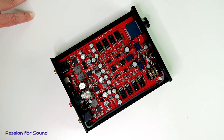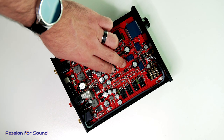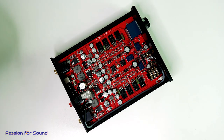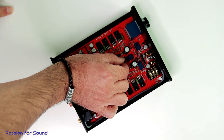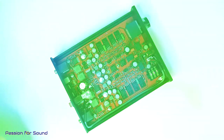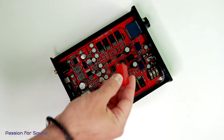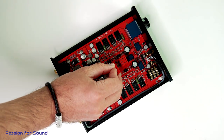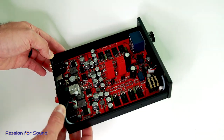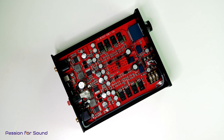Once we're inside, there's very little you actually need to touch. You can see all the circuitry, but the only things we're concerned about are these two chips — the standard JRC 5534 op-amps, which are a good quality chip, nothing spectacular but perfectly okay. With the power switched off, you can pull those out and replace them with whatever op-amps you want; it's just a simple eight-pin DIP socket. I'm going to remove the stock JRC 5534s and place in Burson's own V6 Vivid op-amps. As you can see when I turn the amplifier sideways, they sit quite tall off the circuit board, but the amplifier is specifically designed to fit larger op-amps, giving you plenty of versatility.